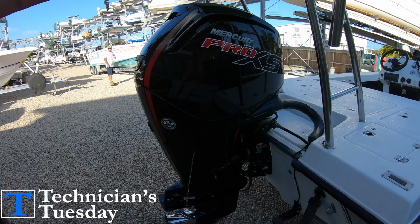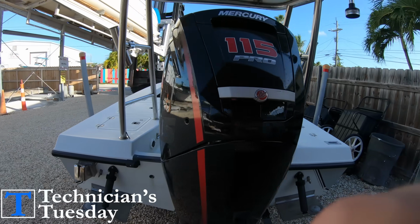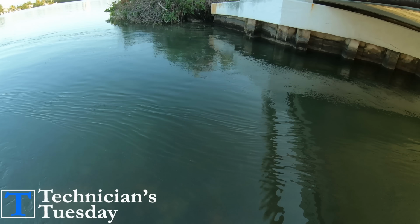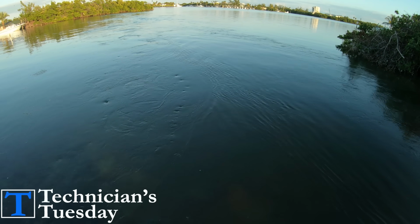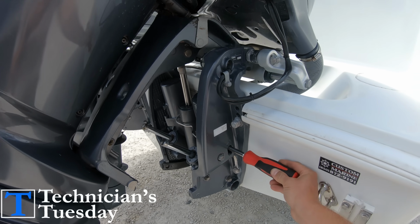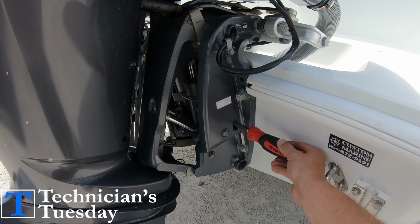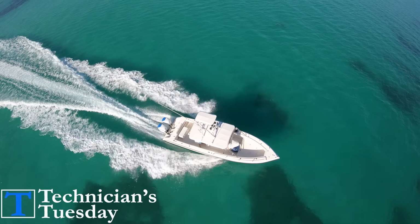Now, not all boats need trim tabs, and most boats don't need to use them all the time. Trim tabs are used to compensate for changes and differences in the weight distribution on the boat, the water current, and the wind conditions. Sometimes people get confused between the trim and tilt system that is on the engine, but they are not the same thing. I'll put some links in the description to some other videos and articles on our website about the differences between the two. Trim tabs are most useful offshore and in heavy flowing rivers.